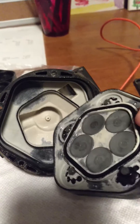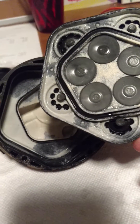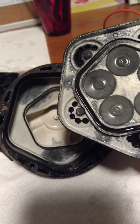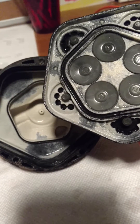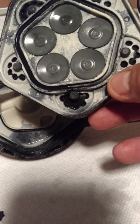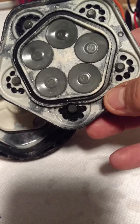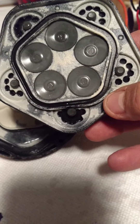I don't know if you can see it, but you see right there? There's those little plastic holes around there that kind of hold the diaphragms in there. They wear out. They break down over time. What happened with this one is it actually broke down and fell out. So that one was leaking — it caused it to cycle on and off.